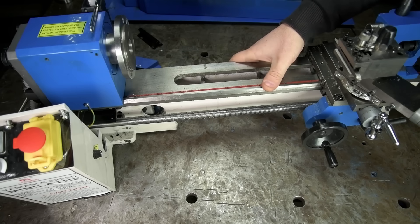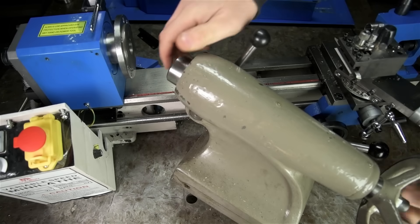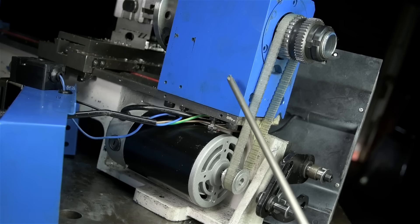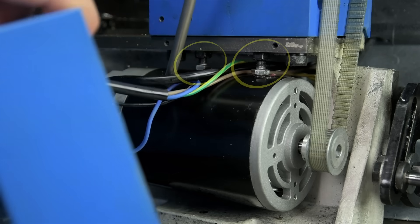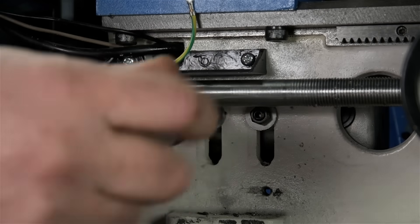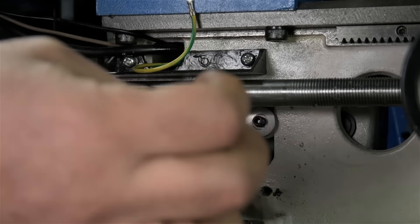Once you take all the bling off, the bed is about three inches square — 80 by 80 millimeters. For reference, this is just the tailstock from my Colchester Student; that bigger lathe is older than my grandpa but only cost me about 800 bucks. I got all the hardware off the back. Once you get the gears off it's really only two or three screws. To separate the headstock from the bed there are four socket head cap screws. There are also two jack screws that create tension on the belt and two studs that mount the motor.